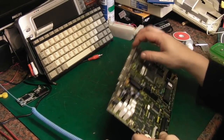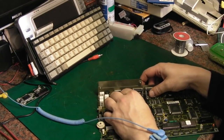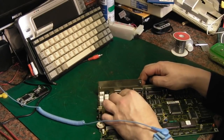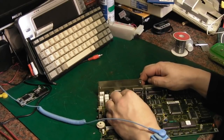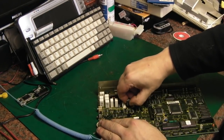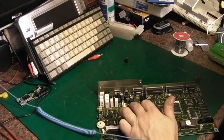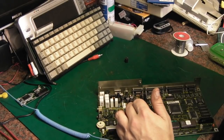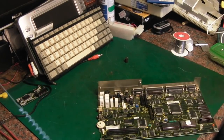I wonder if it would be better getting them off the board — pulling them off and then desoldering the legs from this side, because there's so much surface mount stuff around them legs. I don't want to risk taking the wrong component out. This is a technique I have used before: if you basically break them loose and pull them out, you see we've left the two legs behind there — that's what the foils inside the capacitor were connected to. If I was being really snide, I could just solder a new capacitor straight onto those bits.